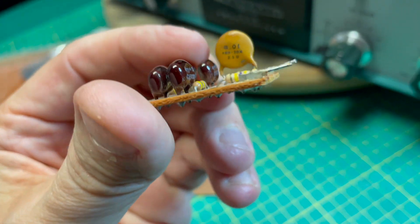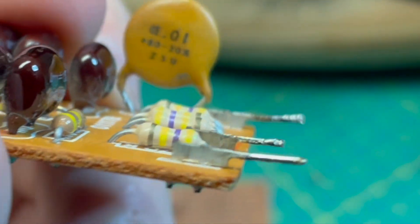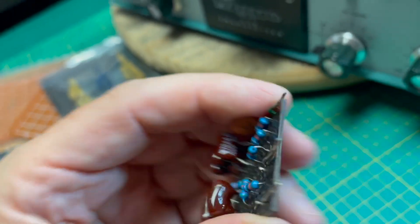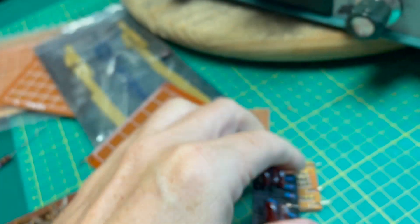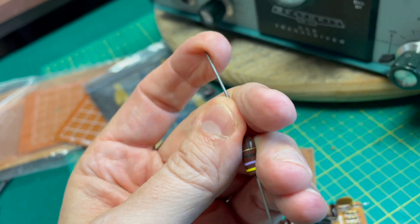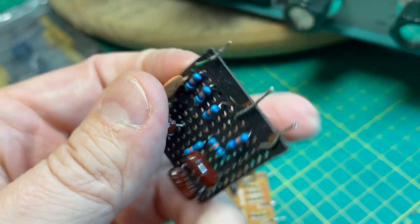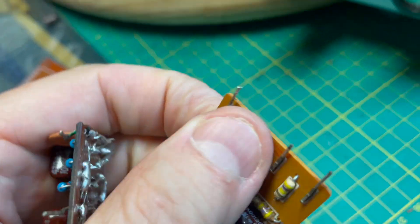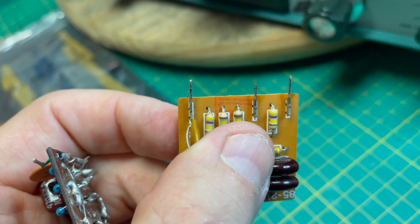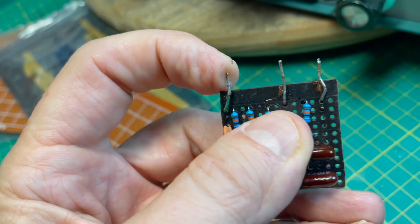The original phase shift circuit board had these three F connectors that attached it to the audio board. I could not find those anywhere, so what I ended up doing was improvising — taking the thick leads from a 2-watt old-school resistor and shaping them to fit. I kind of like these better because when you have rigid F connectors, you better be sure the holes on your board match exactly right, and invariably there's a little difference. With these, you have a little bit of wiggle room, literally.